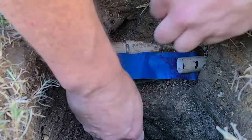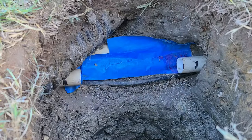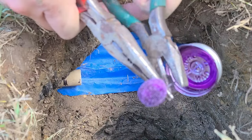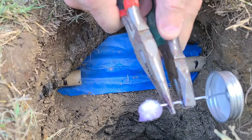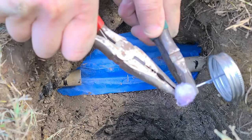I have some other pipes and wire running nearby — I don't want to get any cement on those, so I'm using painters tape to create a barrier. When we go to install this coupler the workspace is going to be tight, so you can bend the ends of the PVC primer and clear cement applicators — that'll make it much easier to get good coverage.